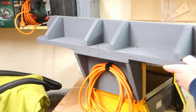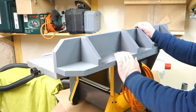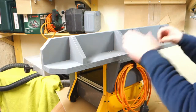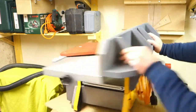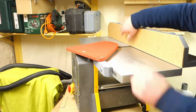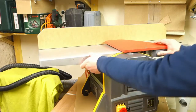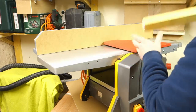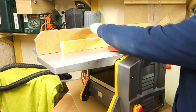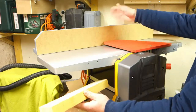Let's start with the fence. Why don't I make this fence movable? It's easy — I don't need to move it, and I'll tell you why. When I plane on this side and then I want to plane the other side down, I just flip it. So that's why I don't need to move the fence.